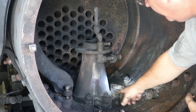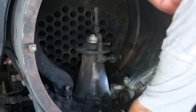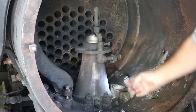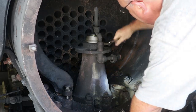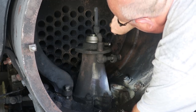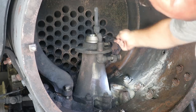Here we are in the locomotive. You can see the exhaust comes up from the two cylinders, comes through this piece, and kind of pulls them together — two different inlets joining together. This exhaust nozzle just drops right down in that hole and basically takes the diameter of that pipe and constricts it down, which increases the flow velocity of the steam coming up. The smokestack is right above it, and that's what will help create draft inside the smoke box to help the fire burn hotter. There's a set screw on the side — I'm going to tighten this up. You can adjust it up and down to get your draft just right. We'll start with it right there and may play around with it once we get the locomotive going.